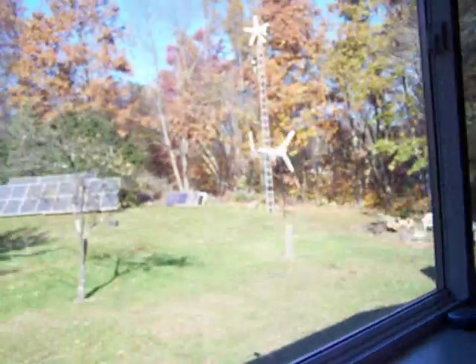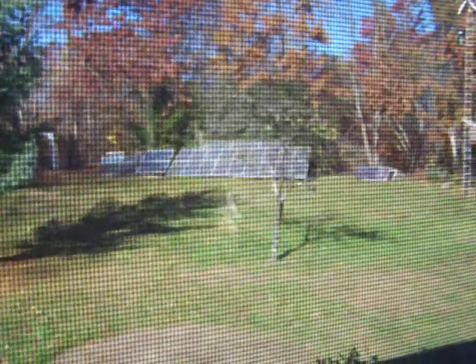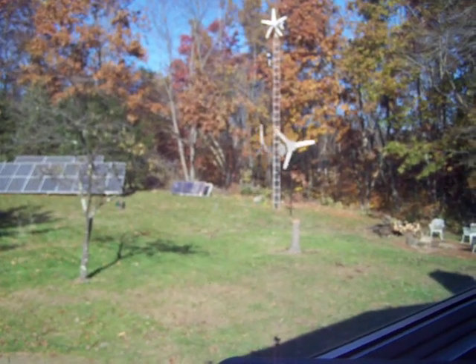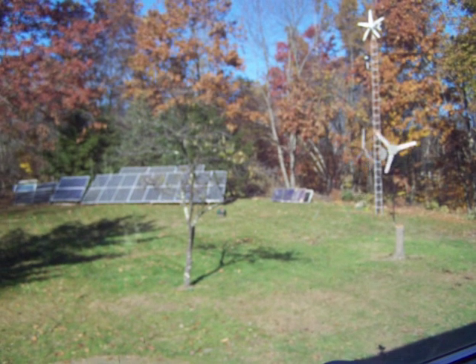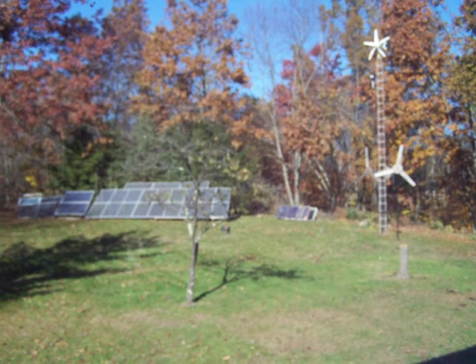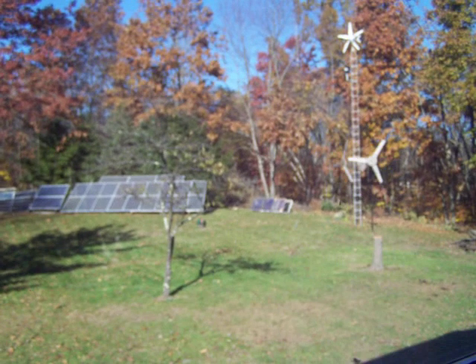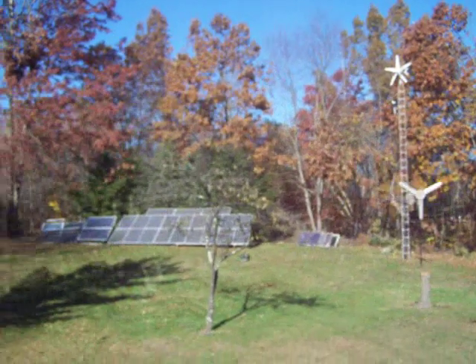For those of you who are getting started: get a few solar panels and figure out if you want to charge batteries or if you want a grid tie. If you want to charge batteries, get yourself a charge controller and a couple of 12-volt deep cycle batteries. If you want a grid tie, I recommend the Enphase inverters, but they're expensive. The plug-and-play grid tie inverters work excellent too and they're a lot cheaper — they just plug into a wall socket. Some guys frown on them, others don't. In my eyes it's all what you want to do — to each their own.